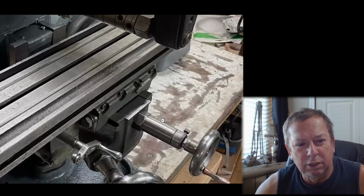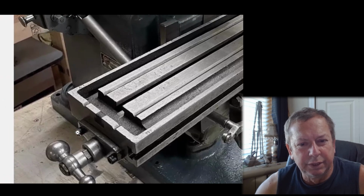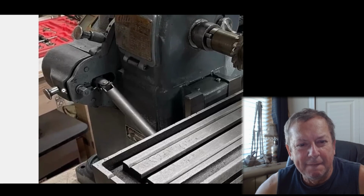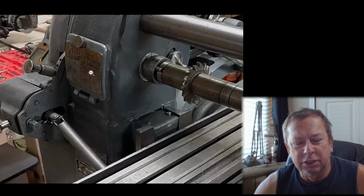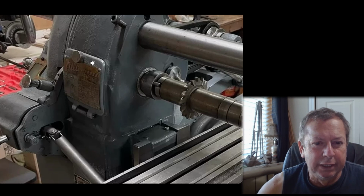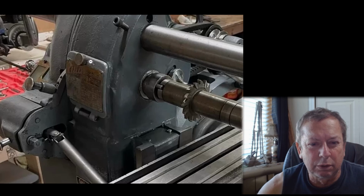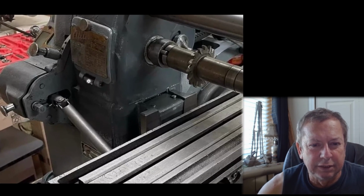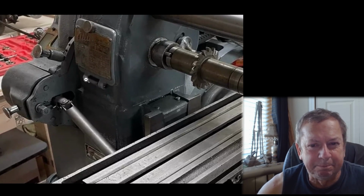And this is where the overarm support clamps on. That's not the original lock. Those are not the original screws holding the end on. All of the colors gone off of these plates, and you'll notice on this machine that there are at least 2 different colors. This door, I initially thought, that's not the proper knob for there. I initially thought that there was no paint on this one. Now see, this is an earlier casting because it just has the pin going through, and the center part of the casting is cast into the headstock. So it'll be earlier in that respect.